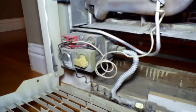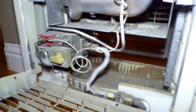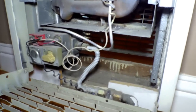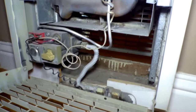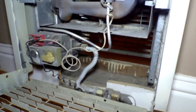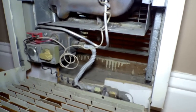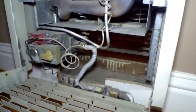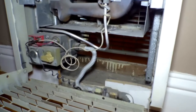The pilot is off. That's what you want to do in case there's a gas leak in your house — you want to turn off the gas just like so. Now all the places that have gas would be your water heater — you do the same thing — your oven, same thing behind the oven. You could pull it out, or the best thing to do instead of doing everyone individually, you could go outside on the side of your house.